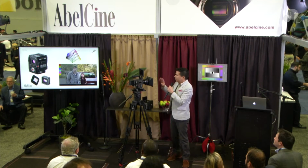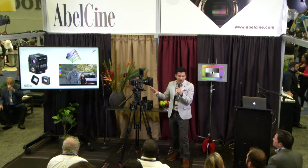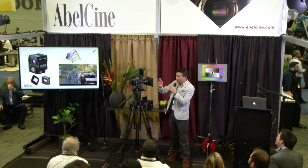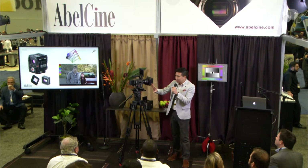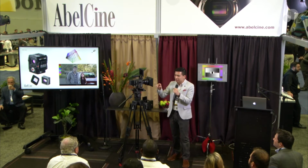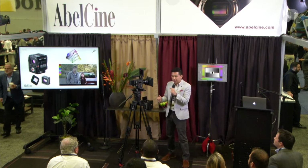DSMC1, again, was possible to do as well. Just needed to use 4 screws, not a big deal, but again, it does auto-report that now, which is a fantastic option. Also, 3D LUT loading capability internal to the new DSMC2 line. So on the Weapon carbon fiber, the 2 versions of the carbon fiber, you are able to load up to a 33 cube style LUT, standard 3D LUT. On a magnesium Weapon, you're able to load a 17 cube LUT, as well as on a SCARLET-W, you can load a 17 cube LUT as well.